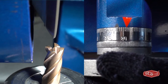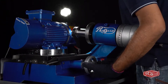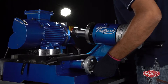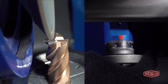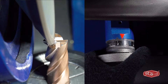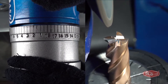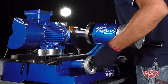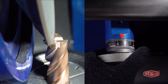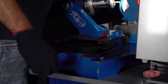Using the Y-axis, bring the diamond wheel to the end mill cutter and sharpen to the depth equivalent to the depth noted earlier. Then take the diamond wheel away from the end mill cutter and set the pin on number 18 instead of number 9. Using the Y-axis, bring the split line flute of the end mill cutter closer and sharpen it to the required depth, keeping in mind the number 95. To sharpen the second split line flute, move the Y-axis away, set it to number 18 on the opposite side of the current number 18. Move the Y-axis towards the end mill cutter split line flute to give the required depth of cut, keeping in mind the number 95. Then take the diamond wheel away using the X-axis and Y-axis.